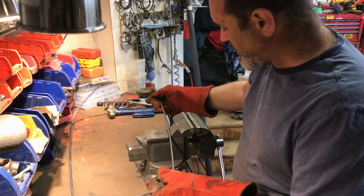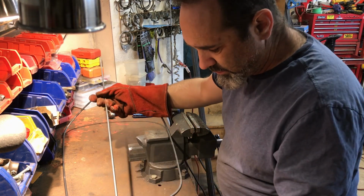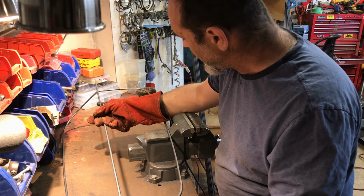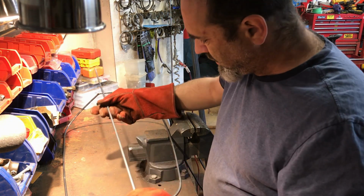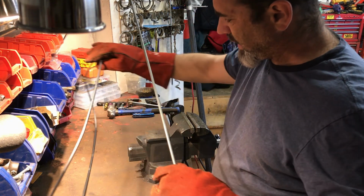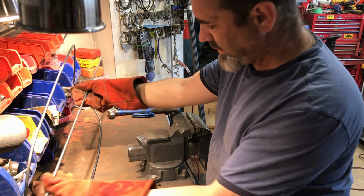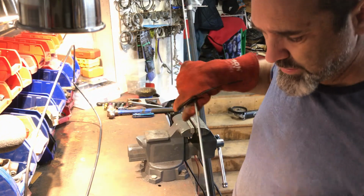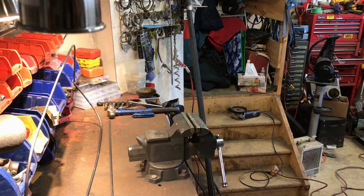next thing I'm going to do is weld a rod in the middle, roughly there. Well, not roughly, exactly there. And once I'm happy that that's all square, I will then make an angled section that goes in to there to join all that together, and then start doing all the vertical rods. Fun times.